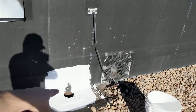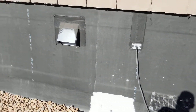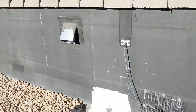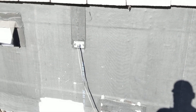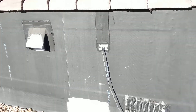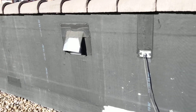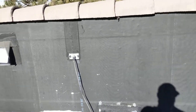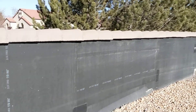The leak was coming from this particular vent right here. They're drainage vents — not exhaust vents or anything like that. This one here is about an inch and a half to two inches from the bottom, and that's a secondary drainage vent that goes straight through the wall of the roof out to the exterior of the building. This here is the primary drainage system, and there are two drains for the primary drainage system.